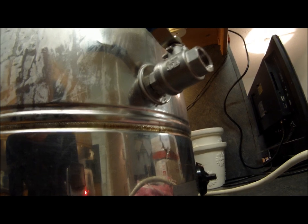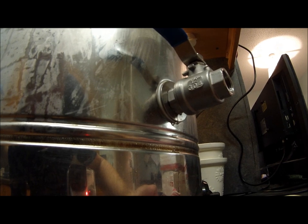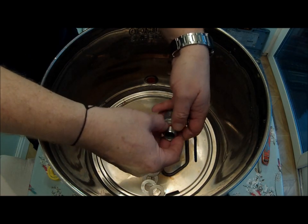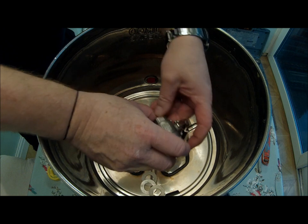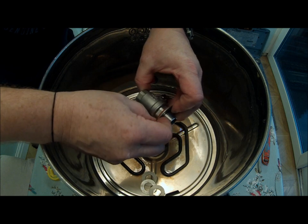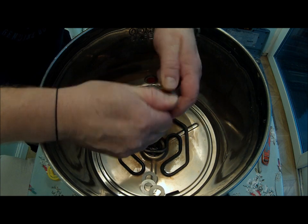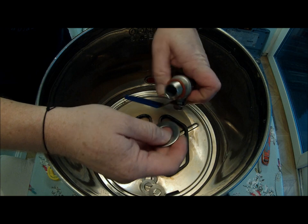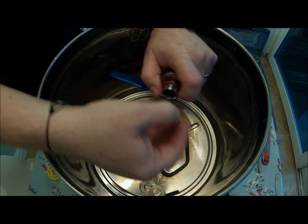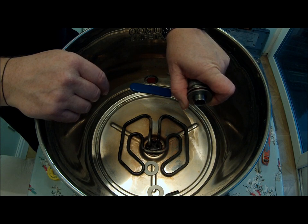I'll see about one of the o-rings between that washer and the tap. I don't think the o-ring is going to work, because as soon as you put the washer on and just put a little bit of pressure on, the o-ring rides straight up over onto the nut of the fitting. I'm fairly sure I won't have enough room for washer, o-ring, washer — and to be honest, that's not really going to do a right lot because you've still got the same problem.